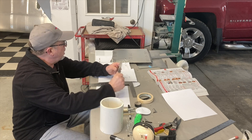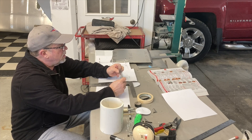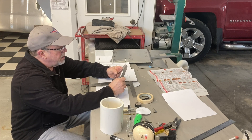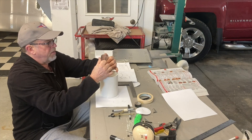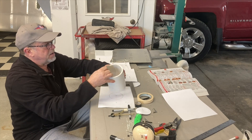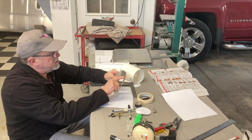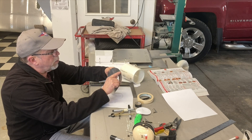I had to make a couple of decisions. I was thinking of making this out of thicker gauge metal, like 0.040, so I could countersink my nut plates. The 0.025 is a little thin for countersinking solid, but I decided it's only to retain the nut plates so I think I can get away with that. The other reason I didn't use the 0.040 is because it doesn't fold up to go in. If I do it just one way and don't put the nut plates in until it's in the plane, it'll keep a lot of its shape — that will pass through the hole if I attach it to a stick. It springs back really well. The only problem is nut plates would cause kink points.